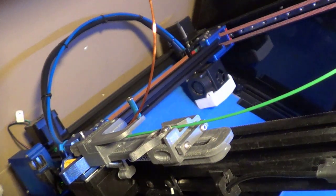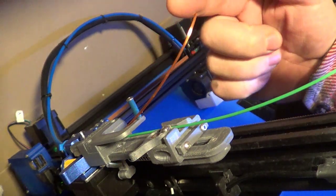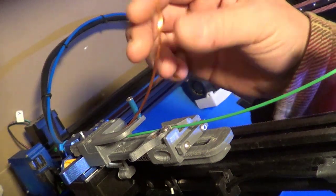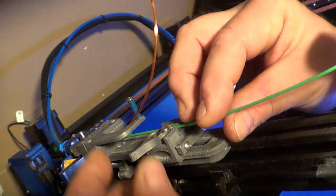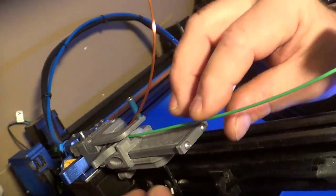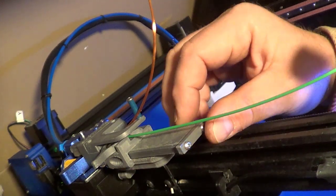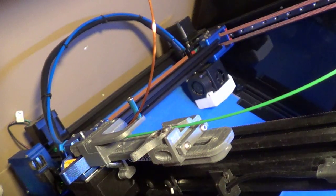I'm going to show you how that works in a minute. The first thing is your filament loads as normal — let's just pretend this one is coming off the spool that's running out. It just feeds down through the small hole, down into the Bowden tube, or through the extruder into the Bowden tube. The next one coming in behind it goes into a small opening. You pull back on the little tab underneath, which allows it to grip the filament and push it against the other filament.